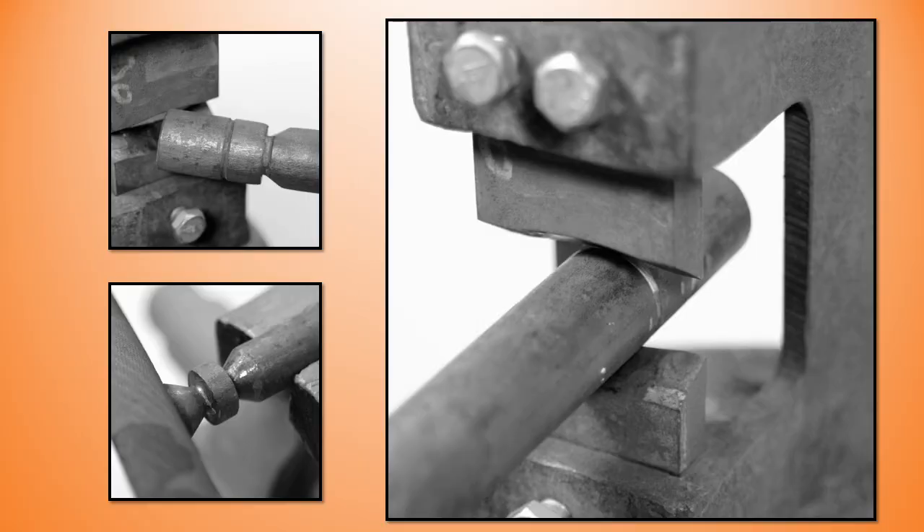The enemy when fully fullering is inertia. If you cut the end groove first, that piece is going to move around in space as you cut the near piece — the bit that's nearest the parent bar. You have a definite stress riser at that transition between the taper and the collar, and when that moves around it's going to result in a crack or the end will just fall off. Cut the near side first and then cut the far groove.